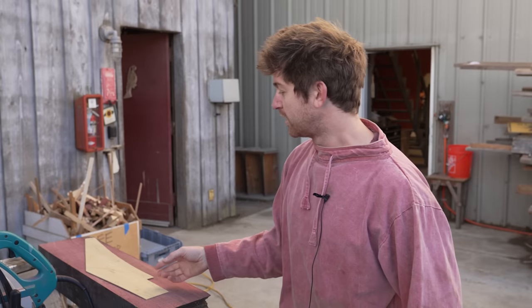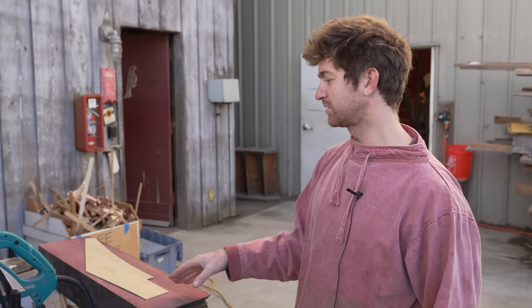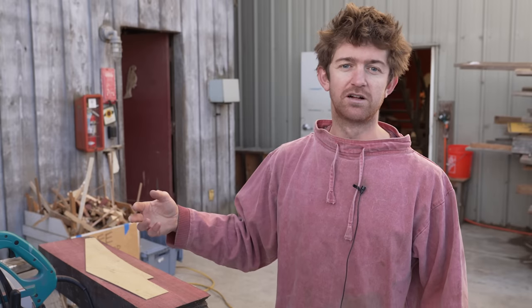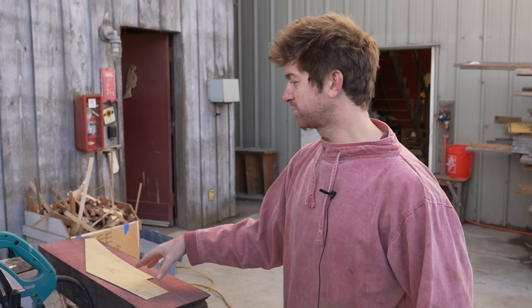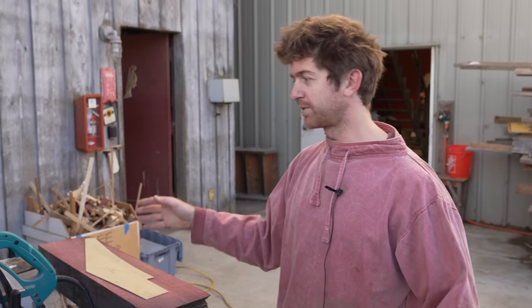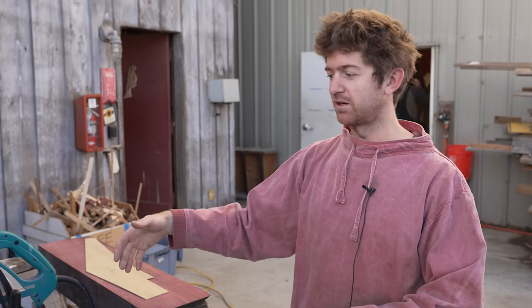Now, this is actually a really unusual arrangement. It's not something that I've ever seen on a boat like this, and it does look a little odd, but it does make some sense, because what often happens is the bulwarks go all the way to the stem, and then a hole is cut through the bulwarks for the anchor chain and the stock of the anchor to go through, but with this arrangement there's more of a slot in between the bulwarks and the stem, and that means you could actually pull your anchor right up from its stowed position.